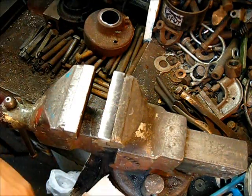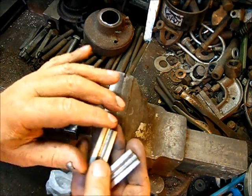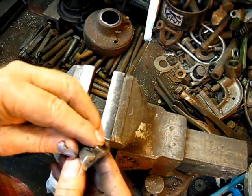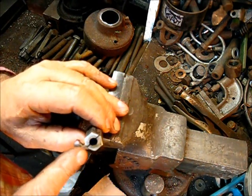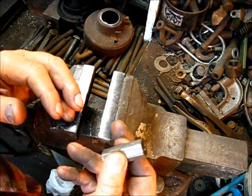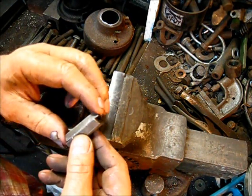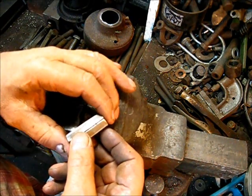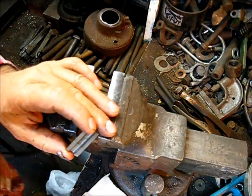I made these two things right here. You're going to need some of these to get them done. This was a piece of hex stock and I already drilled a hole in there — five sixteenths for the total length of it. The length is kind of unimportant; it's just 1018 steel. Then I took it over to the saw and sawed it in two lengthways, and that made it have a saw-blade-thickness gap in there.